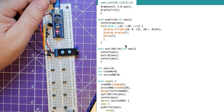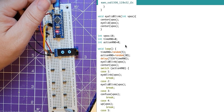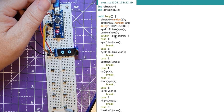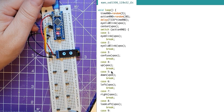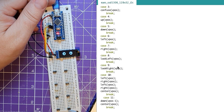But you could take the Pico code and put this into the Pico code as well if you wanted — it's pretty much the same. There's a loop that does all the animations. It picks a random number the same as the other one at the start. It does a center first, and then depending on the number that it picks, it chooses one of these animation routines. I use the case command here as well. So when I've got that random number — it's a number between 1 and 20 — depending on the number, I do something. Nearly half of the time, it doesn't do anything anyway. Sometimes it looks down.